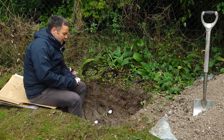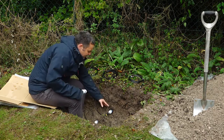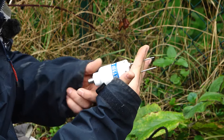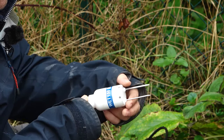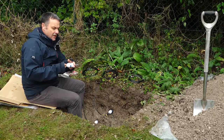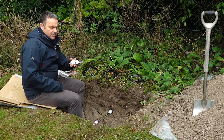Secondly, you want to try and recess your sensor into the profile as I've done here, because if you don't, just the weight of your sensor could cause it to pivot and the sensor could pull out of your soil profile. The pivoting also creates air gaps and voids in your profile where you're trying to measure. Air has a very low permittivity and that could bring your readings down. So you want to insert the soil moisture sensor into your profile to give it some security.